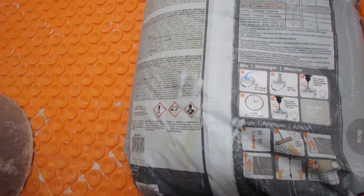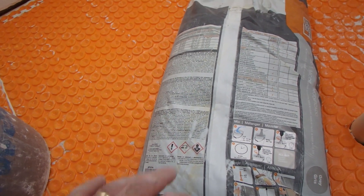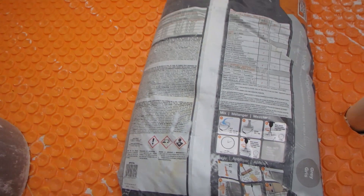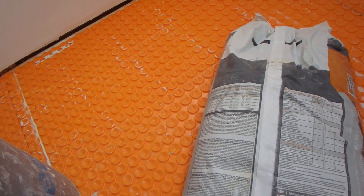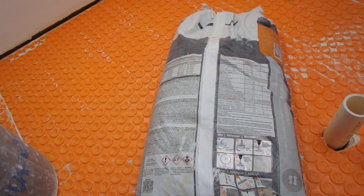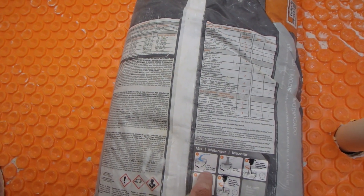The ratio of water is pretty wide — from 5.5 to 6.5 quarts. If you mix it on the low end at 5.5 quarts, you get a sag-resistant, no-sag thinset — you put it on the wall and the tile won't slide. If you mix it in the mid-range at about 6 quarts, you get a good creamy mix for installing tile on the floor. At the high end at 6.5 quarts, you get a good consistency for installing membrane like the KERDI membrane on the wall or the DITRA on the floor.